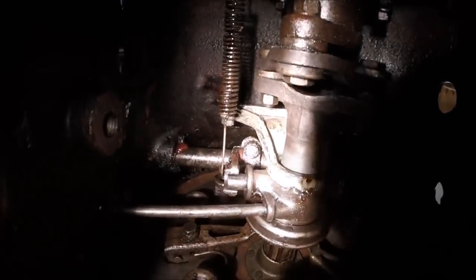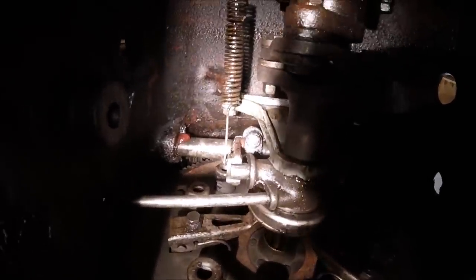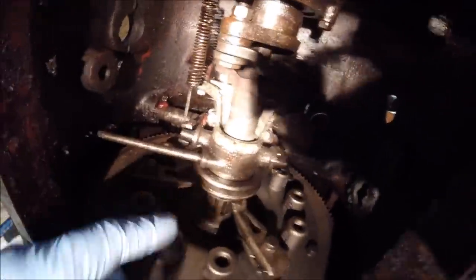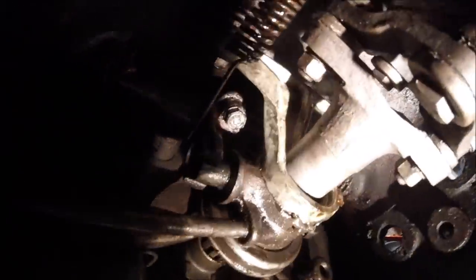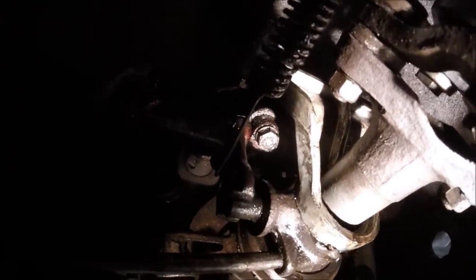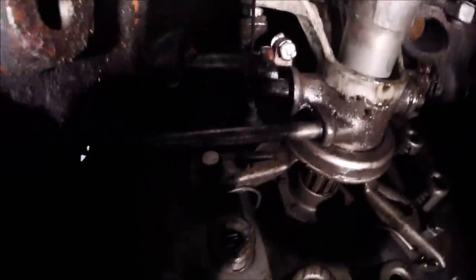There are two bolts for that, and there are heavy washers up above those bolts that go into that keyed shaft that keeps that yoke. I'm trying to hold this flashlight so it shows you. There's a bolt here, and up above it you can see the keyed, or the heavy washer, and the same thing on the other side. This isn't really working very well with the flashlight, but we're going to take those out, take that cross shaft out, and then we'll probably remove the spring